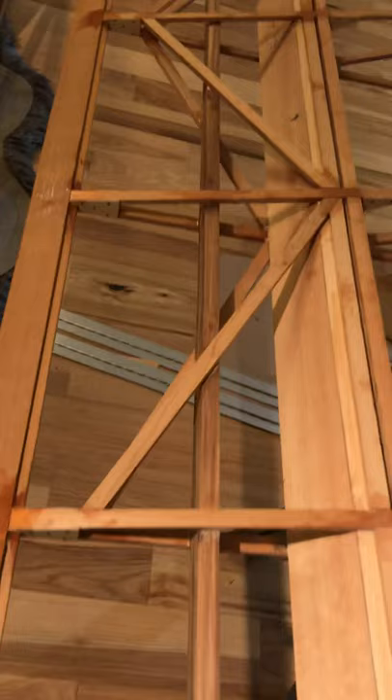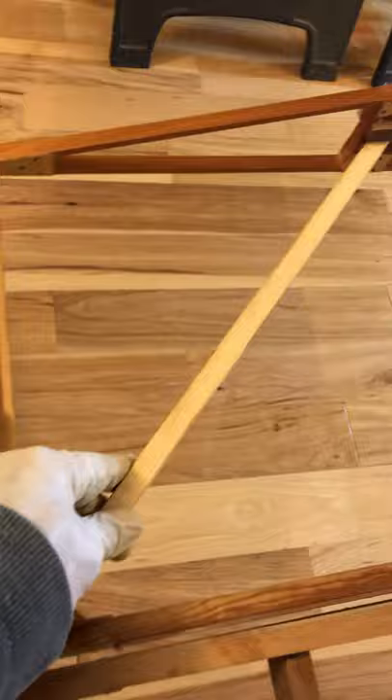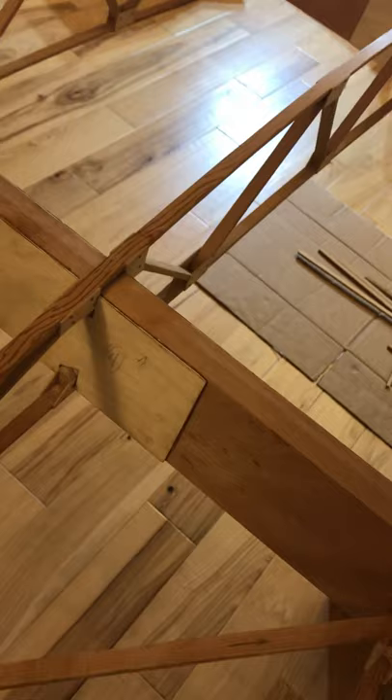A lot of work has been done on the ailerons. All of these have been put in here — all the cross braces you can see here, top and bottom. I was able to flip the wing over to do the underside. Ailerons are in, all of these compression struts have been put in as well, and some reinforcement gussets.